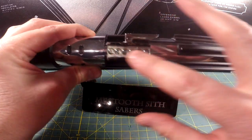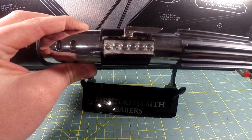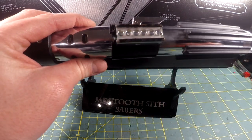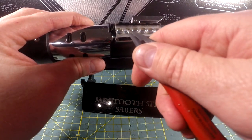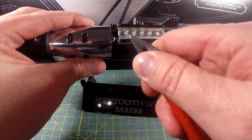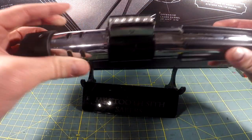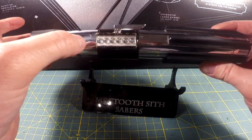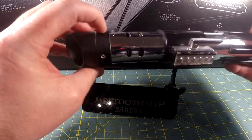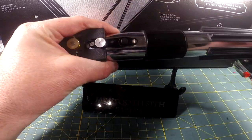This bubble strip here I've actually corrected and fixed — it wasn't accurate the way it was mounted before, it is now accurate. I did the best I could with it and I think it came out pretty good. It does have the clamp card underneath the bubble strip and I added the solder points on the clamp card. I did not do the paint on the bubble strip; the owner did that. I did add slotted screws here and in the control box here to improve accuracy.